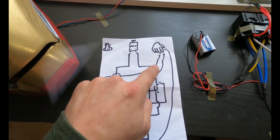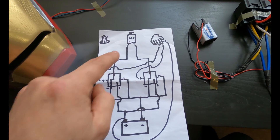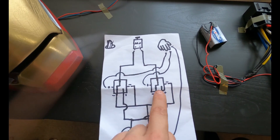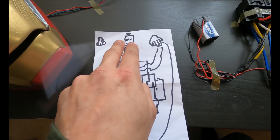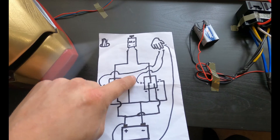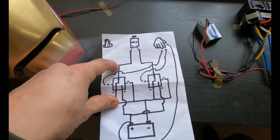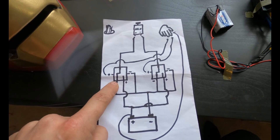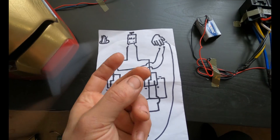Those two limiter switches interrupt these two wires going to the hands. This is the 12-volt supply. Basically I need to switch the polarity on the servo motor, so I have two relays flipped around. The 30 terminals are constantly resting at ground — both sides of the servo motor are at ground. If I want to open, I take this 12-volt and pulse it to one finger, which switches the relay from ground over to live 12 volts. Now one side of the motor is getting 12 volts, the other side is still grounded.